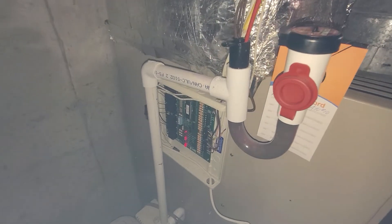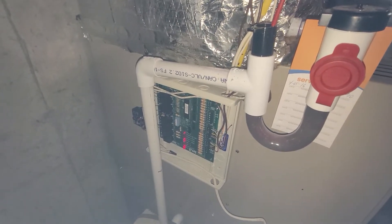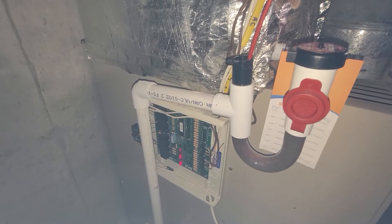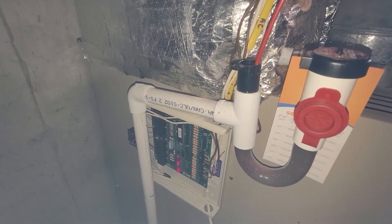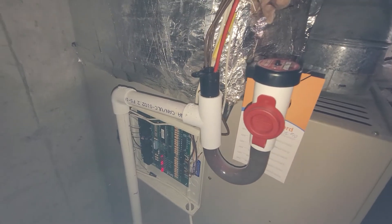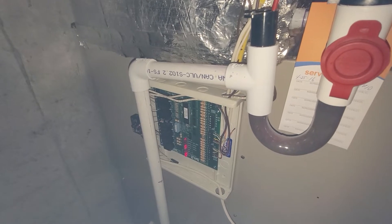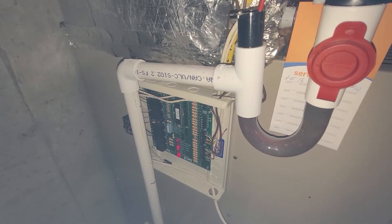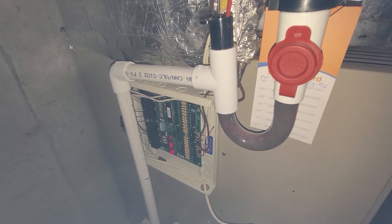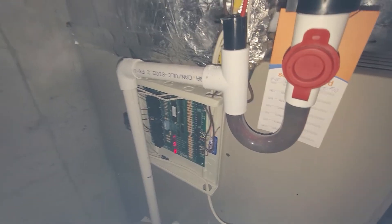Welcome back to my channel. This is a quick follow-up on the EWC controls board that I installed. I realized something when we were getting our air conditioning to turn on within five minutes of the last cycle, and it was a little too short for my liking. We have two Wi-Fi thermostats, one upstairs and one downstairs — one for each zone — and each of those thermostats has a compressor delay start in the event that there's a call for cooling within five minutes after it's shut down, to protect the outside compressor.